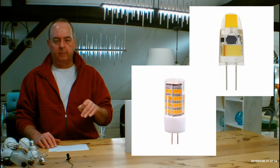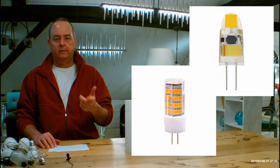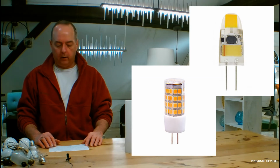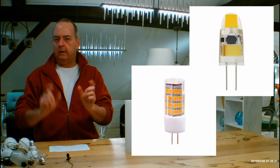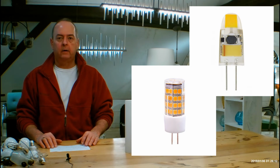To begin with, this is a dimmable fixture, so if you're going to be going for the dimmable bulbs, which I expect you to do, tell your installer that you're going to be using dimmable LEDs so they use the correct dimmer on the wall. When you're looking at all these bulbs, some of them do say dimmable, some of them say non-dimmable, so keep note of that. Also note a couple other things, color temperature.